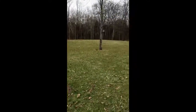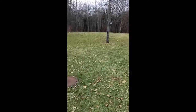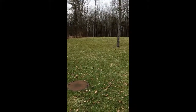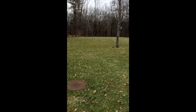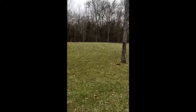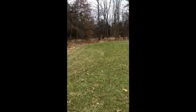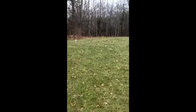You can see the hill in the backyard — that is the secondary treatment system, where the material gets pumped into the top and then gravity and natural bacterial processes work to purify the water before it goes back into the groundwater. This is called the raised mound septic system because of the location of our groundwater. Compared to some other raised mound systems I've seen, this one isn't so bad — probably about five feet off the ground at most.